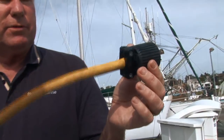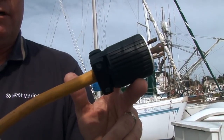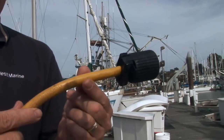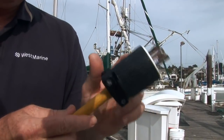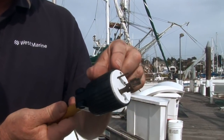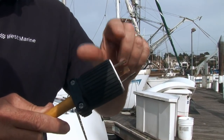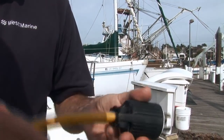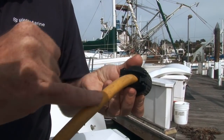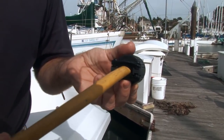This is a situation you find all the time — somebody has made up their own cord, sometimes because the cord became damaged and they replaced just the end, or they bought a bulk length of 10-gauge 3-conductor cable and assembled their own. But this really isn't a marine fitting. The terminals are corroded and slightly bent. They're designed to carry 30 amps, but this cord isn't designed for the marine environment, so you get high resistance. Also, there's no waterproofing — water can run down the back of the cord set, get inside the plug, and cause problems over time.